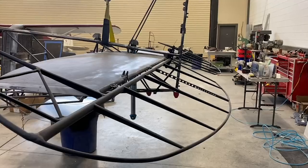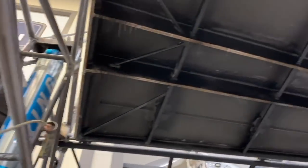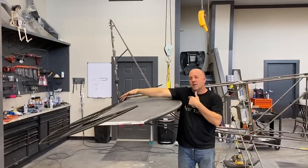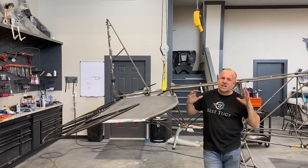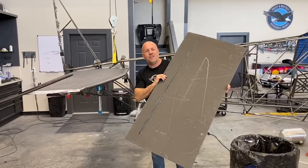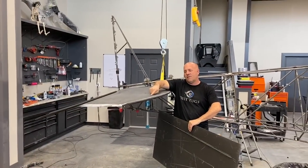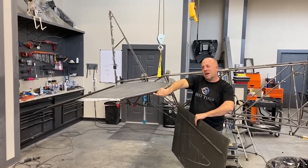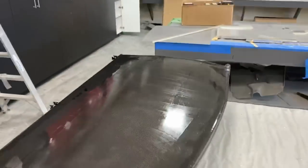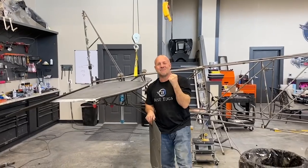These are the sheets we made last night, dried overnight. Turned out really, really well — three layers. On the back side, we've got an embedded rib. Then I got a spar — a spar. Those were done with honeycomb single-layer glass spars. So I have two spars, that embedded rib, then metal and metal. And then I got the arc shape to it. It is so strong and so tight, I couldn't be happier with it. I've got the bottoms I'm ready to put on. I'll trim them out, fit it, and we'll bond them on. After it gets bonded on, I'll carbon fiber from carbon over the glass-wrapped metal and back to carbon — do a couple of layers and bond here, bond the back, and I'll have an entirely carbon-wrapped tail section. Horizontal. Let's get to work. Two more to go.